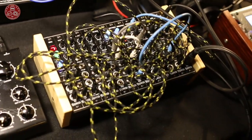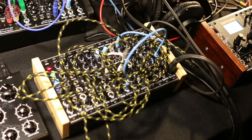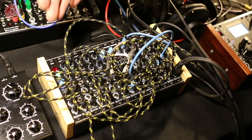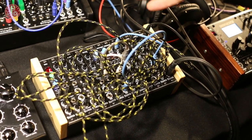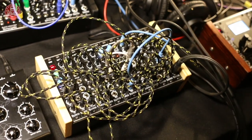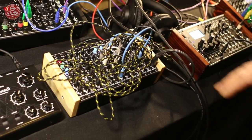Raivo will introduce some features, starting from the VCO which has 2 banks of 16 wavetables and the world's smallest 16-step sequencer which has 8 pattern memory. It has CV control, gate length control, and slide functions so you can emulate 303 bassline scenes.